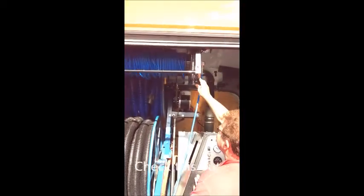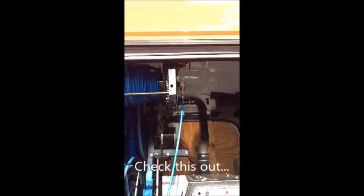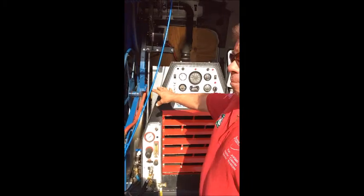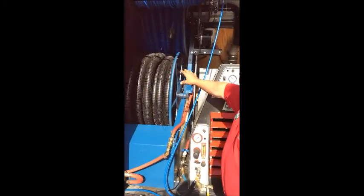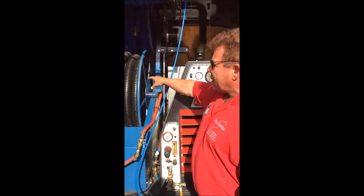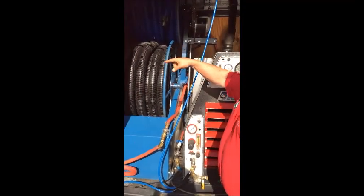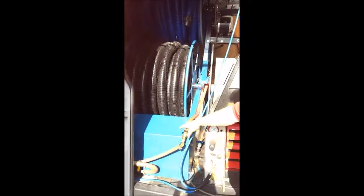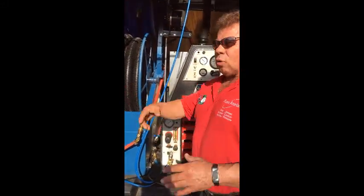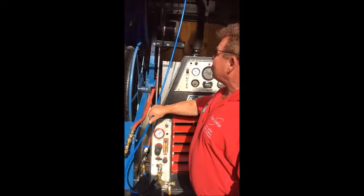Check this out — this is what's neat. I had him install an electric solution reel. It's got about 250 feet now, but it can hold 700 feet of a quarter-inch high-pressure line. This truck is designed for a thousand-foot run. Right now we've got about 450 feet of hose, but I can bring more hose and run a split. It's got an automatic fill — I can automatically fill it or manually fill it. I can run two reels at 500 feet each or one at a thousand feet.